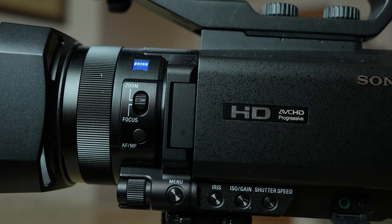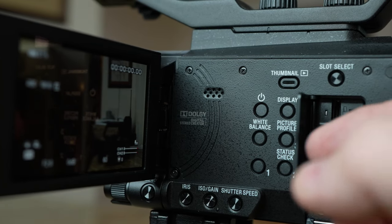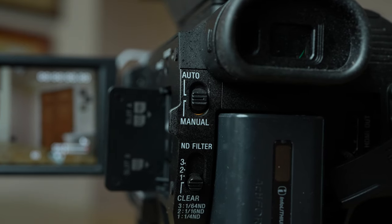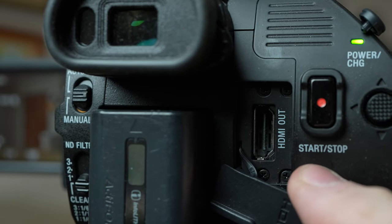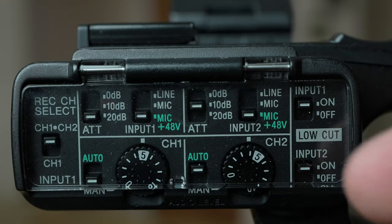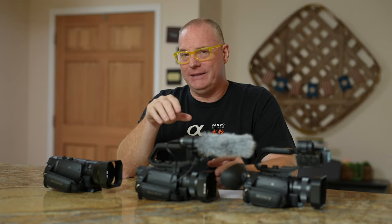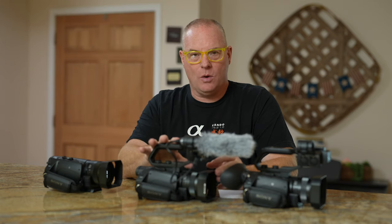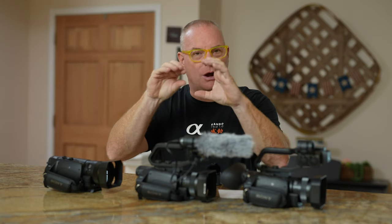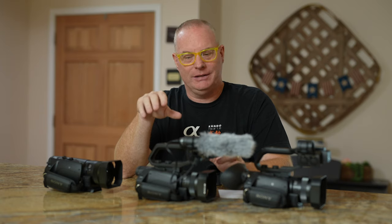The MC88 is really a production camera that's going to be used with other similar cameras, but its limitation is going to be full HD only — it will never be able to use 4K. If you're a church building your facility and your switcher is only capable of 720, this is overkill. If your switcher is 1080 it'll work perfectly. However, if you get a new switcher that's 4K capable in the future, this camera becomes obsolete. How much 4K is really happening out there? Honestly, not that much. But if you shoot in 4K you can zoom in and roll across and kind of cheat, so the production value of having 4K cameras, even if you're not doing 4K output, is still relevant.